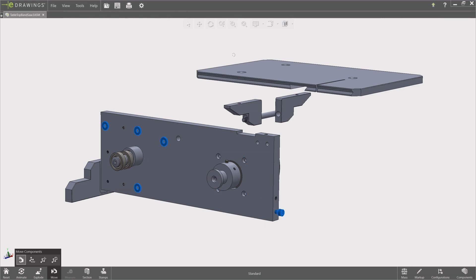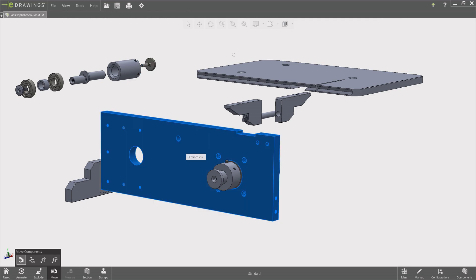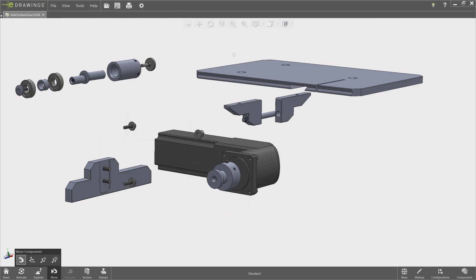Let's look at some details of the construction using Thomas's 3D model. Here the chassis is with one of its wheels and the adjustable axle. Not only can the saw blade be tensioned by rotating the two eccentric axles, but you can also tilt these axles with the help of the four set screws so that the saw blade is guided nicely in the middle of the edge of the wheel. This is a one-time adjustment. A set screw, a key, and a washer with bolt are needed to connect the drive wheel rock-solid to the axle of the gearbox.